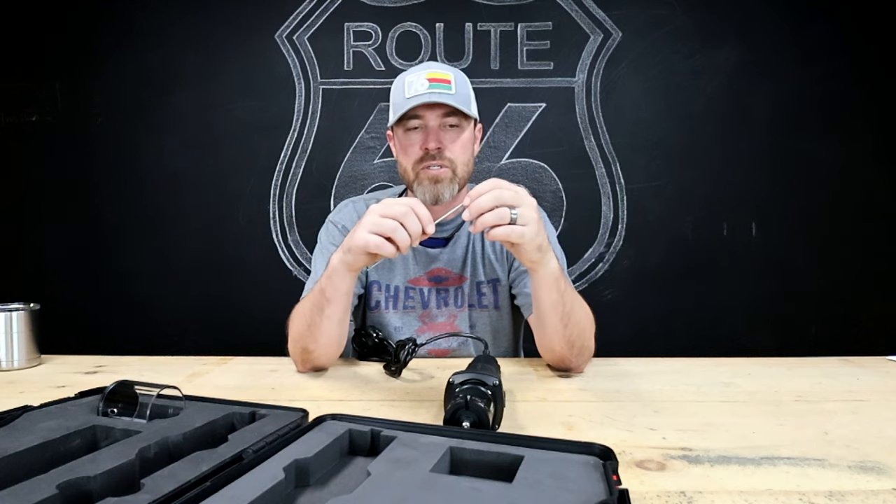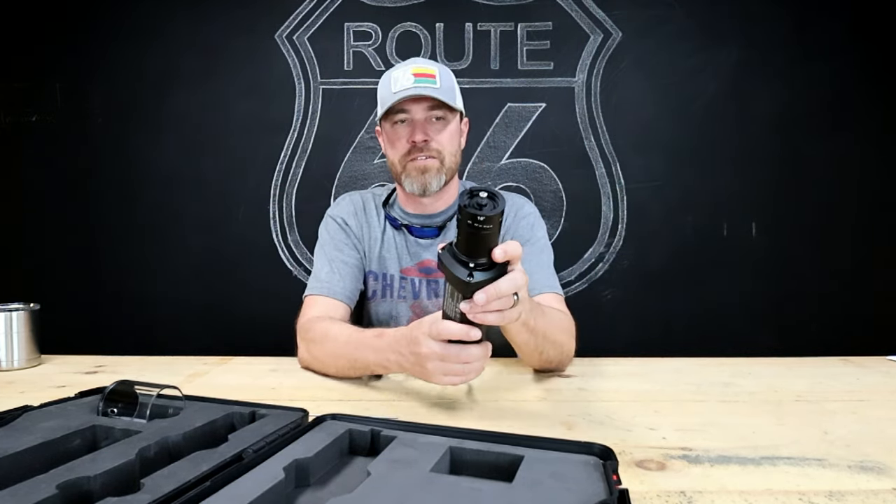Sometimes you want to get into a tight spot — you want to penetrate more, bring those angles in a little bit, get a tighter cone and a little more control. It really comes down to personal preference, how you like to sharpen your tungsten and what kind of cone on the arc you like. With this grinder, you get all of them.